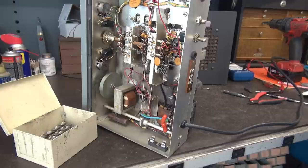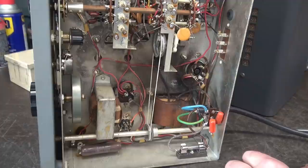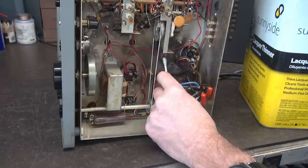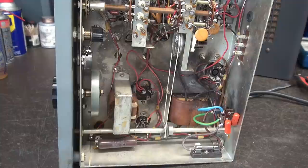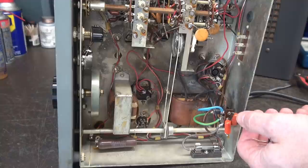There's our new fuse holder installed and grounded power cord. But before I power it up, I'm going to see what I can do about cleaning some of this carbon off here, to eliminate any chances of high voltage getting on that and shorting out. Good news - this is just smoke residue. This was not live electricity jumping around on the chassis; it's coming right off with a little bit of lacquer thinner. So I'm sure the power transformer is fine.